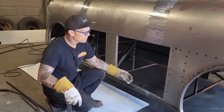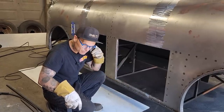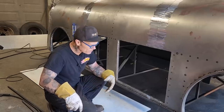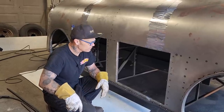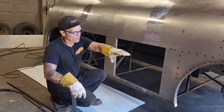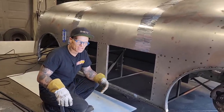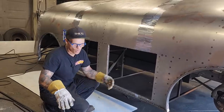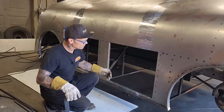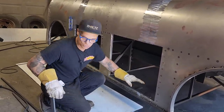That way, I am not wrestling with it or fighting with it. I know it's gonna fit. And basically, I think that's probably the easiest way to do it. And that's the thing. When you start getting boxes like that and you're trying to square them up center to center, how much time can you spend messing with it to try to get it centered or get it square, or get the measuring tape, hold the measuring, make a pattern, make your bends fit your square box that you've got, slide it in because you know it fits.